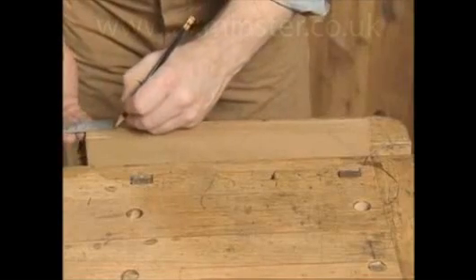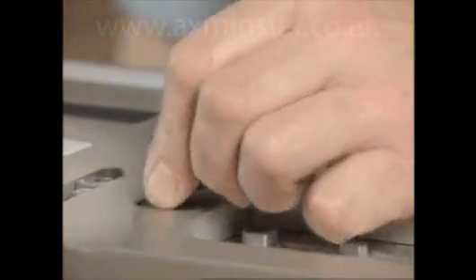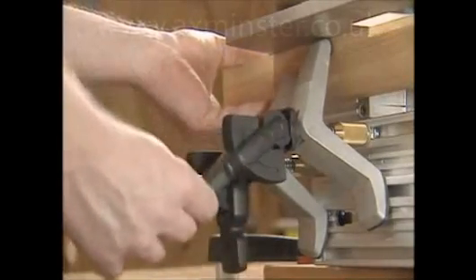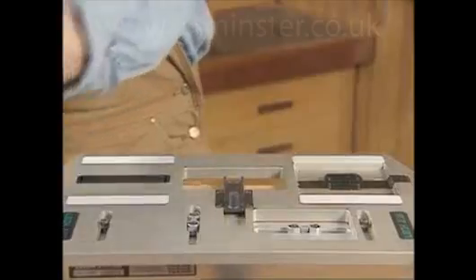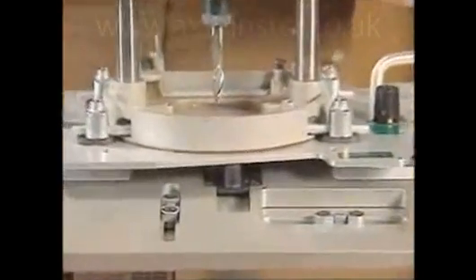To create the matching mortises, the center positions of only one mortise workpiece are marked. The sight is extended out to its stop. The mortise piece is moved over until the cross is centered under the sight, then clamped in place and the sight retracted. If you forget to retract the sight, the sight knob will remind you by making it impossible to set the sub-base in the guides.